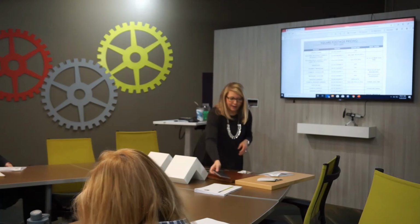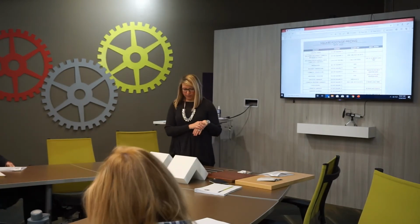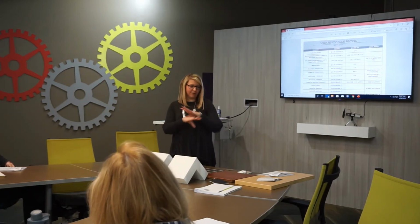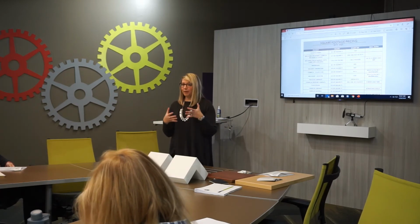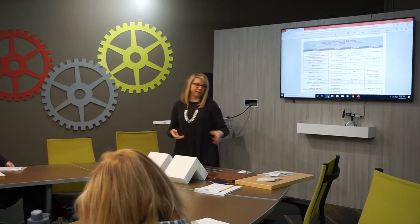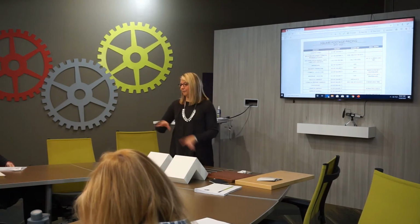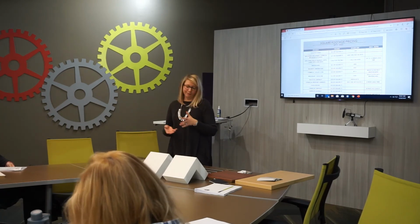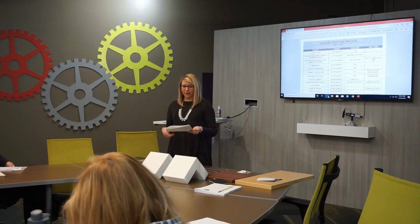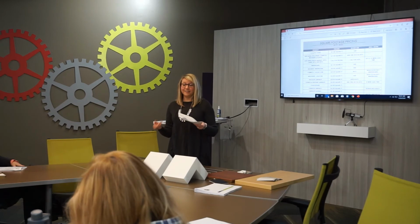If you find yourself in a lab situation, any of the laminates from Wilsonart or Nevamar can have something applied that they call a chemical resistant laminate. It's a protective surface applied to protect it from all those chemicals and anything else you'll find in a lab. Again, we're charging $35 a square foot, and that has a much longer lead time. It's for sure eight weeks because it has to get prepped.